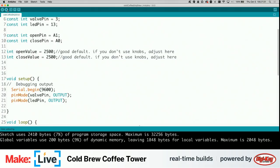So something about this soldering makes the voltage drop. Wonder what that could be. I wonder if it's my diode. Now, normally you'd want to have that in there for safety reasons, but I wonder if it is what's messing me up here, or if I perhaps soldered the diode in backwards, which is entirely possible.